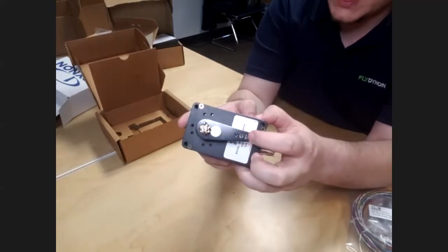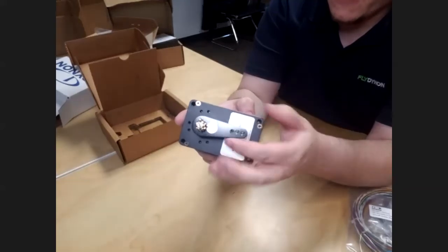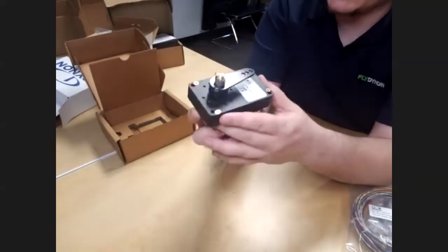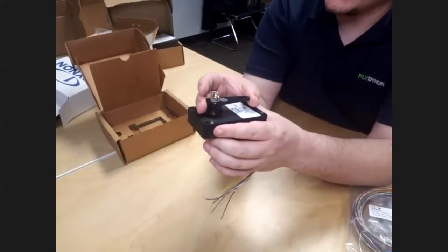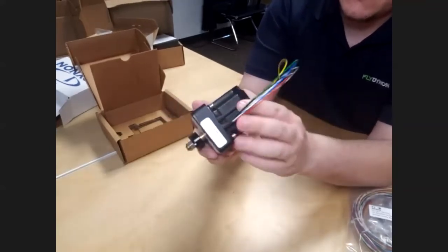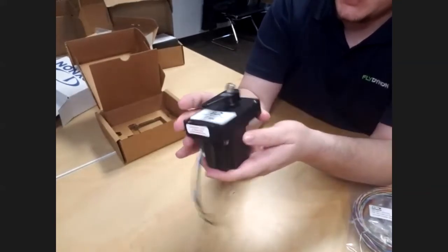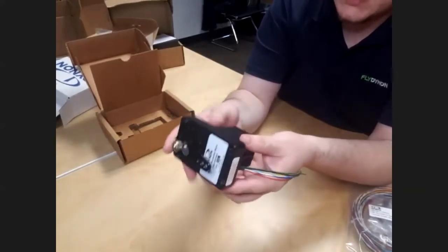Even within one arm size, you have three holes to choose from. So within one arm, you've got some adjustability, and there are longer and extra long and short arms that fit just about any application. These are also available with a capstan drum, which is what's going to connect to a cable controlled aircraft. Many certified airplanes use that, where some are a combination of push rods and cables. So different applications, the servo mounts a little differently. There are a lot of orientations. There is no way it's always got to be up, down, left, right, sideways. It kind of doesn't matter depending on how your aircraft is.